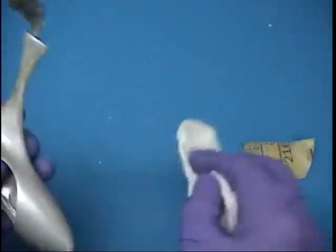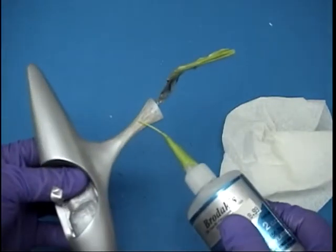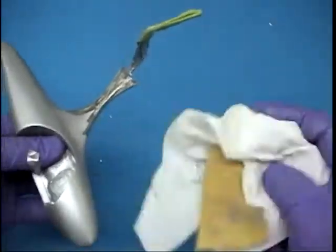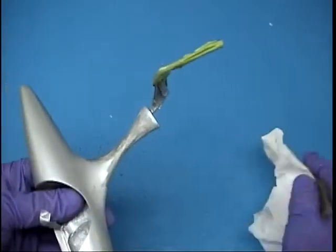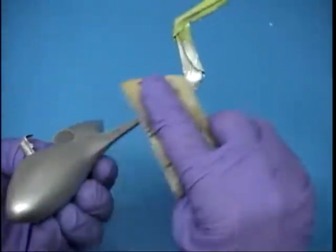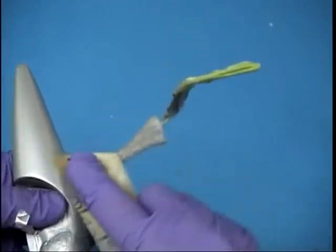In this case, I know I'm going to need a little extra material because I am really down into raw wood here. So what I can do as a first step, can do the usual thing with the thin. The thin seals it, penetrates real well, seals it. You never want to just leave it on there more than a second or two. Now once that's done and that's penetrated in, and it's not even dry yet, I'm scuffing it up because that's going to let the next coat bond. It's going to give it a tooth, a physical tooth, let the next coat bond right in there.